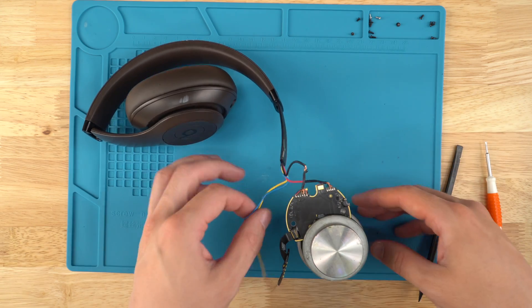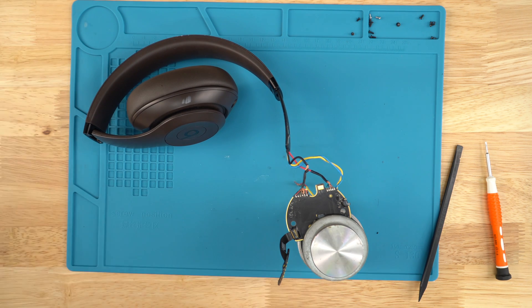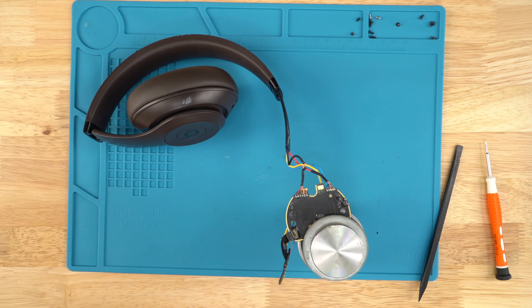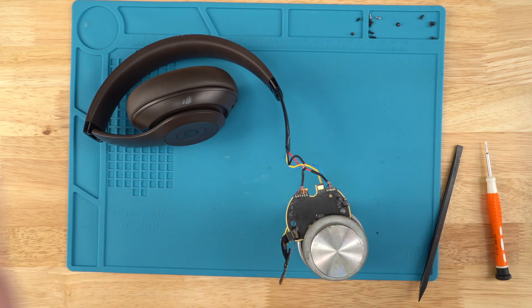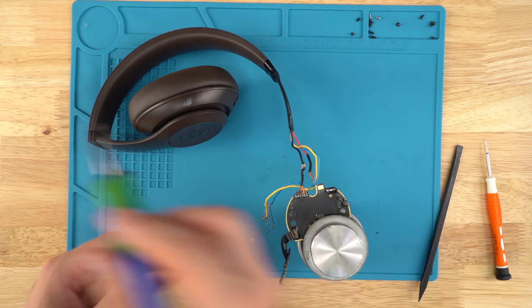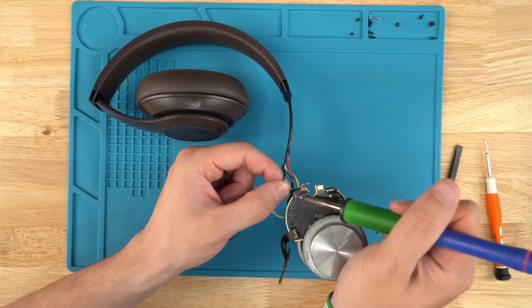We will flux these guys up. When you're reassembling it's very important to take pictures of where the solder points are. You should also have a repair guide with schematics, but you can probably find one online. Just take a picture — you've got red, copper, green, copper, green, blue, and red. Schematics are very helpful. If you don't solder them in the right spot, you'll have problems for sure. We'll start here on the right side. I don't like this solder tip — everyone else likes it but I like the curved one, so I'm a little unexperienced with this one.